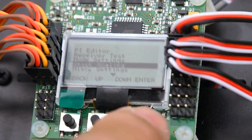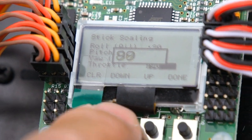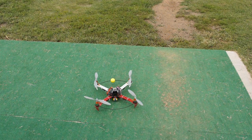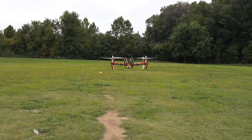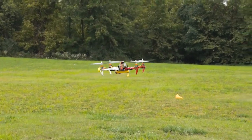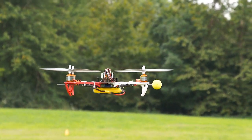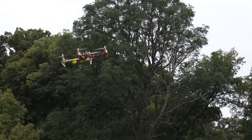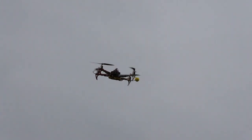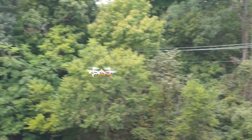We're going to go back into the menu and get into the stick scaling, and I'm going to bring the throttle down a little bit. I had it set at 90 — let's bring it down to 80. Hit done and get back out. Alright, let's see how it works. It does make it less sensitive by lowering that number, so that should help out if you're having problems with the quadcopter wanting to go up and down a lot. Again, this is all just going to be learning because I'm not used to flying a quad yet.